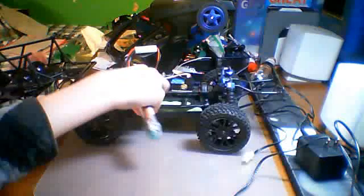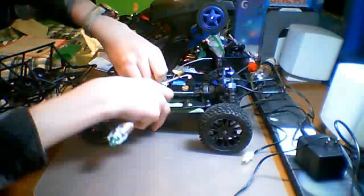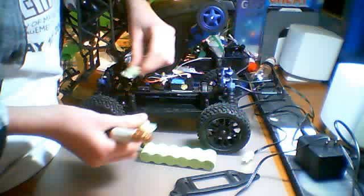I got a spare battery for it. It's an NiMH, 7.2 volts. I got the exact same thing, 7.2 volts and NiMH, but because this one is a certain type and size, it didn't fit. It was like 50% or 2 times the size I needed. So right here, I'm going to read it off for you. NiMH 2/3A, 1,100 milliamp, 7.2 volts. Then it plugs in, boxed in, and it's circle on one side, square on the other. That way, if you want to get another battery, you know what to look for.